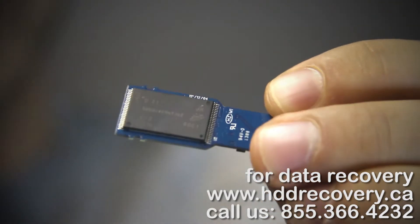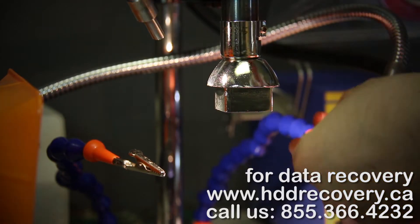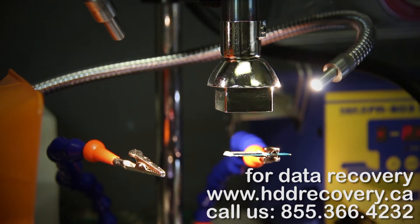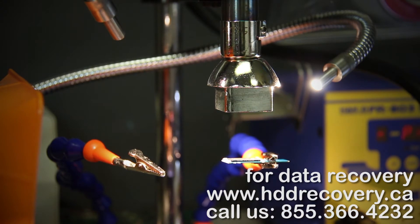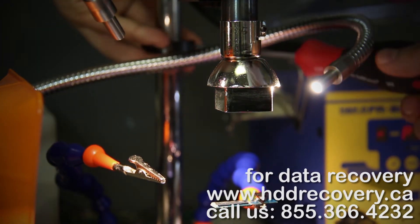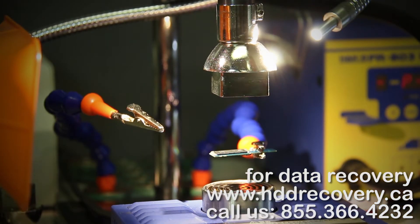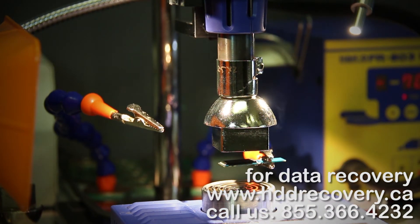This is a Micron chip, so the quality of the read will be extremely close to original. The flash drive is now on a jig and we just applied a little bit of flux to help with the desoldering process. We use preset settings on our rework station — the preheater works at about 250 degrees Celsius, whereas the top heating element runs at 700 degrees Fahrenheit.